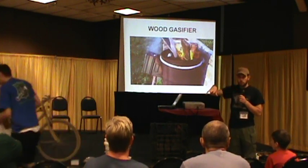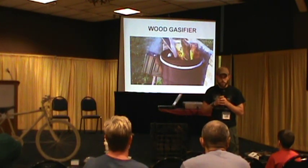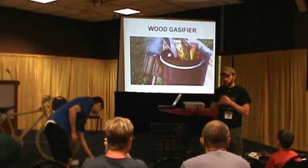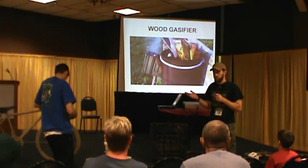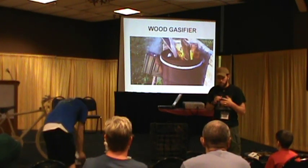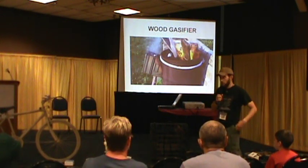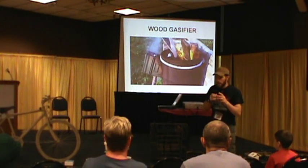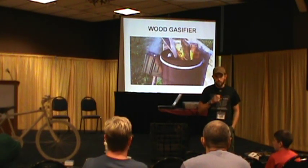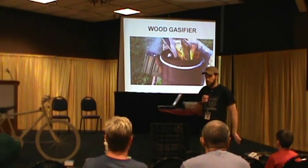Wood gasification — if you've seen my spot on Doomsday Preppers, that wood gasifier we build — you can find the entire build on YouTube from start to finish making a wood gasifier. But I will caution you, out of all the build preps and things I build and share with people, please be careful making that. Wood gas can be dangerous. You're dealing with electricity going into a generator and making fuel in place of gasoline. The most expensive component is the hose because you have to get NASCAR-quality heat hose — the only thing that will hold up to that temperature. When you get wood at 450-something degrees, you are definitely cooking, and that char gas comes off and makes your fuel.